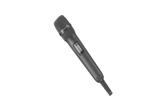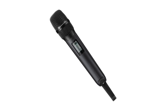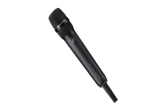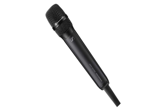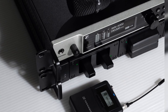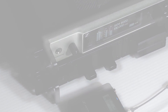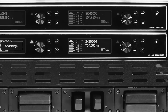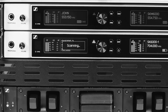In this short video, we will give you a brief description about TrueBit Diversity and the differences to TrueDiversity. TrueDiversity, as we have already said, is a standard reception format accepted in the industry as the best way to ensure strong robustness of signal reception. With TrueDiversity, we have two reception paths that are always receiving the same signal. Within the receiver, both signals are measured regarding their strength, and the diversity path with the highest strength is chosen and used solely for further processing.